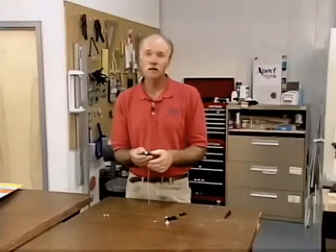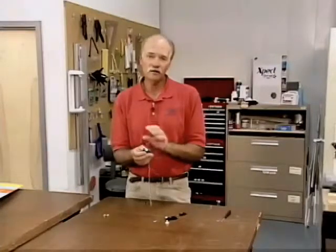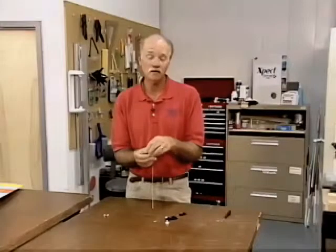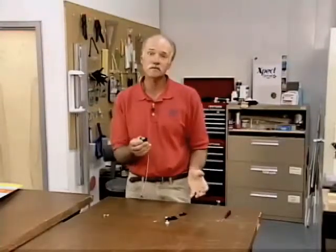If you're uncomfortable doing this, send it back to your supplier or manufacturer and they can change these things out in minutes and get your servo back to you. It's not a difficult job — just be careful, watch how they come apart, inspect each gear, and if you find broken teeth, replace the entire set. Carefully put the top back on, check it out with your transmitter before you put it in the aircraft, and you ought to be ready to go.